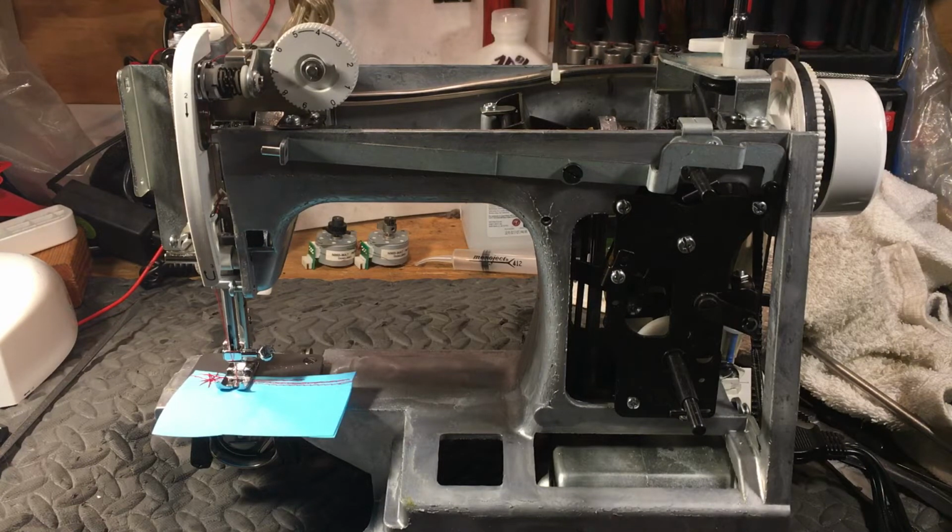And you might say, well, is there any other kind? Yes, there is. The old trusty ones, the cinematic stuff like that, they don't seem to give me much bother. But the new ones, when they lock up, this one came in locked up. When they come in locked up, it's just, well, get after it, because it could be anything. You have to take everything off, all the shrouds, go to every bearing, because you oil it and say, well, that's good. Nope, you gotta sometimes take it, spin it, take it apart.